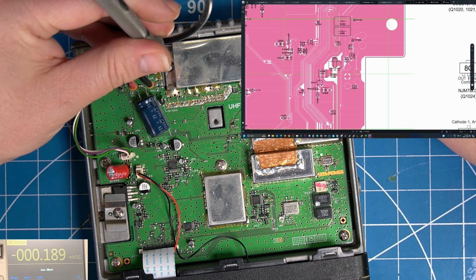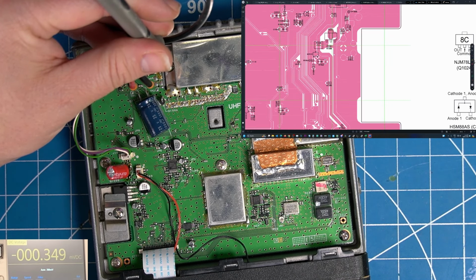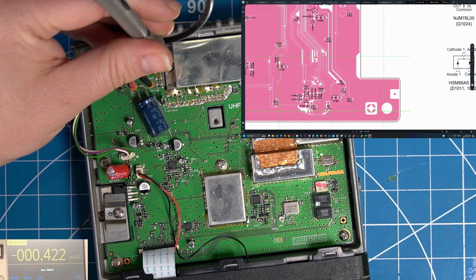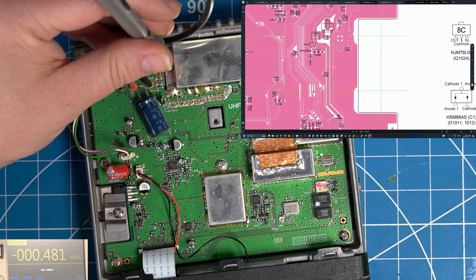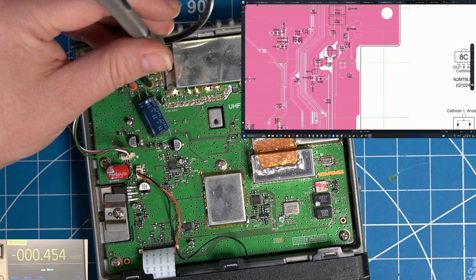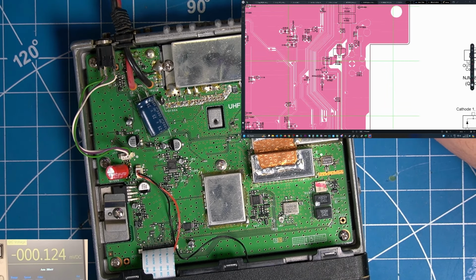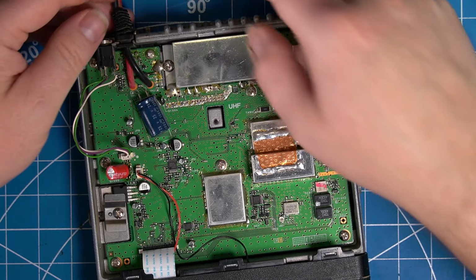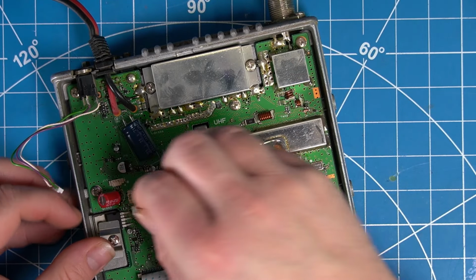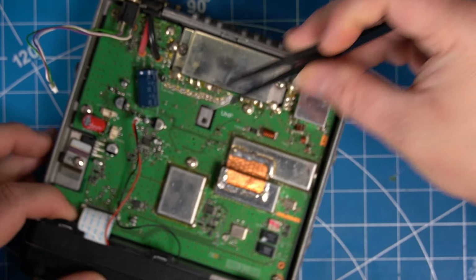1538 and that 13.6. There is a big trace. This giant trace here looks like it's a 13.8 line. So, I mean, the rest of the radio's on. That does look like our main 13.8 volt trace. So we are getting it through there. It's just a matter of, is this transistor bad? An input or anything? Okay, well, I guess all we can really do now is pull the board. So let's do that. Pull everything up. Put our ribbon cable up here.